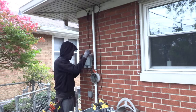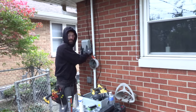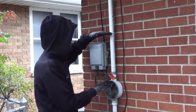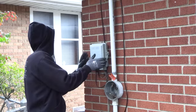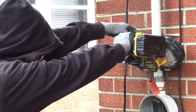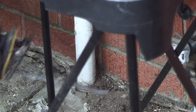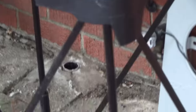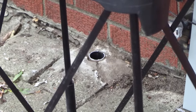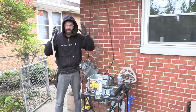I'm going to clean up the outside of the house. Looks like we've got cut wires here — I need to inquire with the customer to see what's in service. I've got to relocate the demarc, put my meter base at maximum height, the trailer panel below that, and then core penetrate into the house to get this cleaned up. We always do site visits before service upgrades, so we should be prepared.